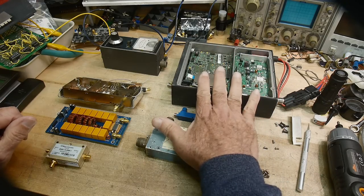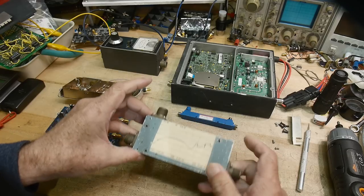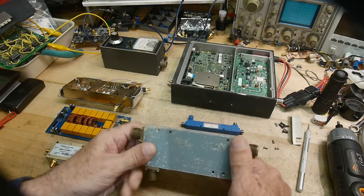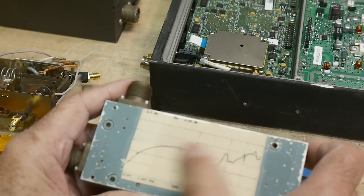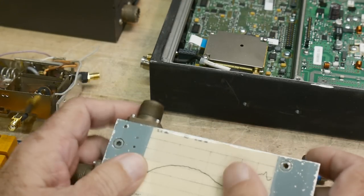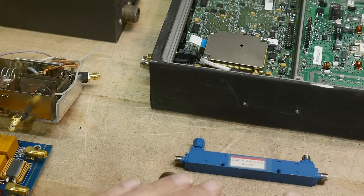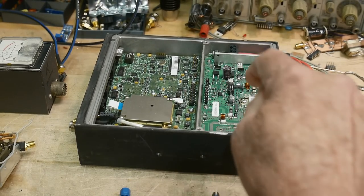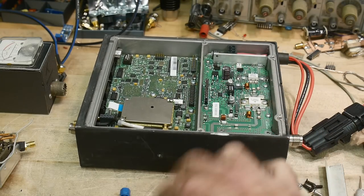These three here are kind of the classic transmission line couplers. I showed this one before — here's a nice big one. I'll see if I can take this one apart. These basically have the same specs. This is my graph; when I had the capability I measured it up to 17 gigahertz. It's kind of a one to two gigahertz type of coupler — looks like it's a 10 dB coupler. There's also a coupler in the output section of this amplifier to make sure your SWR is correct, and these should all look basically the same.